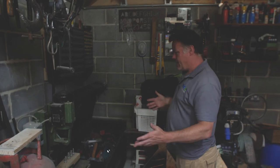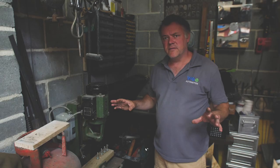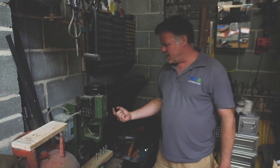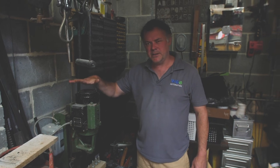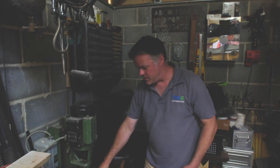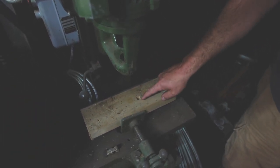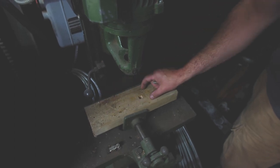And then we're into mortising machines here that you guys have never seen, but I very rarely use it. I've got a massive selection of mortising bits, but this makes a funny sound when it runs, and I think it's because it's running the mortise cutter off central, so it's got a bit of a squeak to it. I'm completely in the dark mortising. Well, here you go. That's a mortised hole, so it's cutting square holes and stuff. But obviously you don't just punch a silly little hole. You might mortise out a big trench.